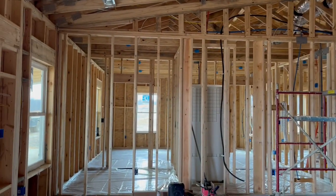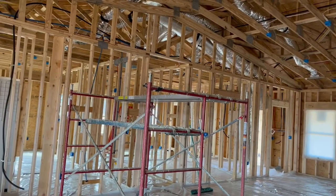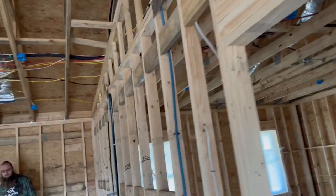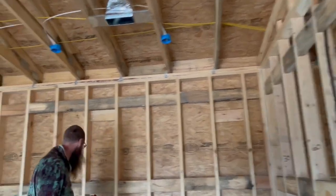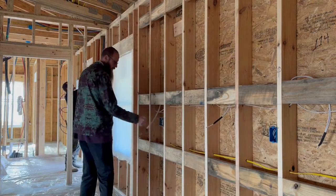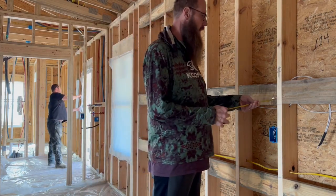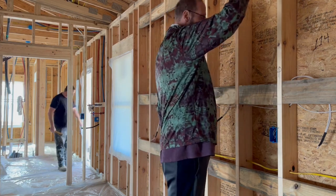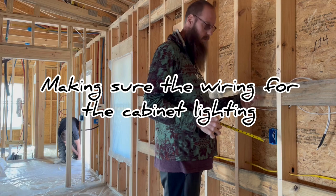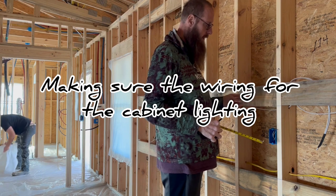Isn't that cool, guys? He's putting up plastic around the windows so that those are covered and don't get sprayed — it can be quite messy. So the question becomes, in this wall, we have to decide whether this comes underneath or goes over the top of it. My measurements are telling me it's going to come underneath because 42 inches per height gets us right up there, so we'd be underneath this block. The power is going to have to come out underneath here. If our cabinet is set up here we'll go over the top, but our cabinet is going to be in this region.